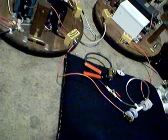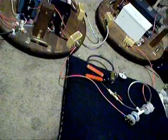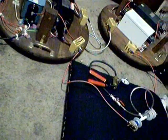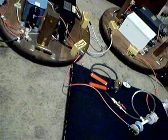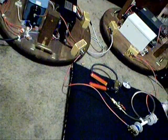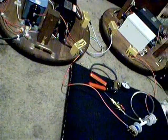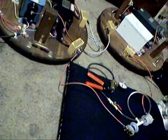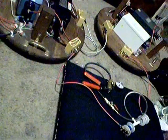Here we have the same setup with the vacuum tube hooked up to the high voltage transformers, except this time instead of putting the tube directly across one transformer — when I did that last time I had both transformers on, so we were actually getting 60 milliamps and the tube got a little bit too hot. What we're doing this time is actually transmitting the power from one transformer to another, and the tube is going between the two. We have the air pumped out, so I'll go ahead and close the valve, disconnect the pump, and then switch on the transformer.